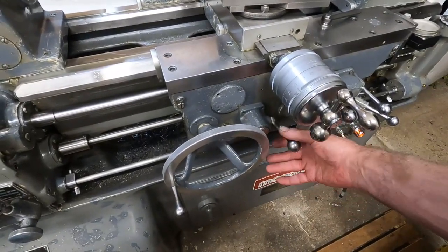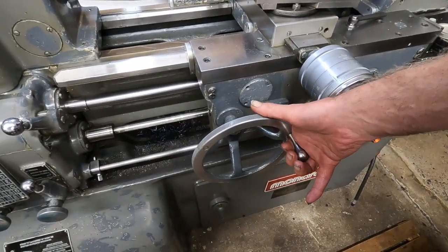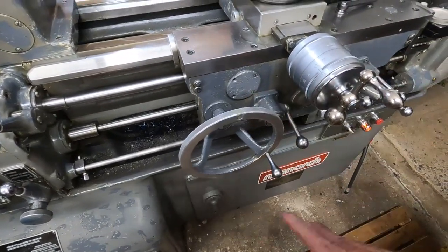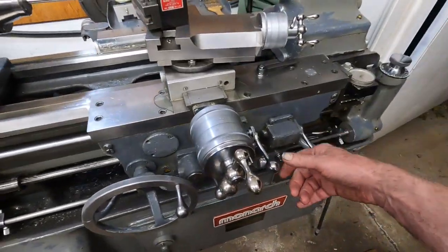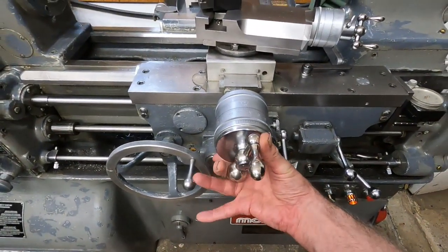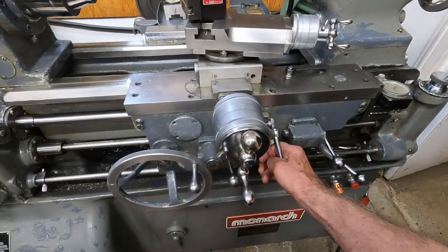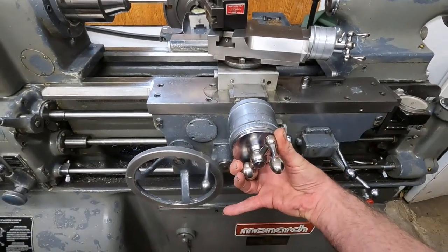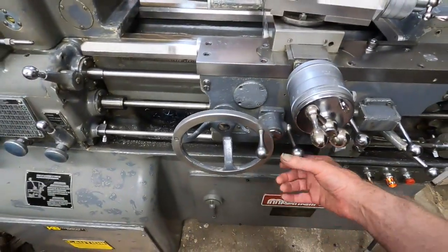I don't have this on very tight — just that much. Then you grab the handle and you want it to stop doing that jerk motion. When it's smooth, you know the clutch is oiled and it's smooth as silk. Let's try the cross slide — got that on lightly and I'm going to grab it. See? Smooth. Tighten it a little more and it'll get to a point I can't hold it, but it's not jerking like it was at first.